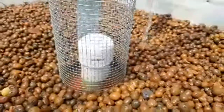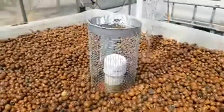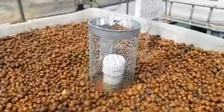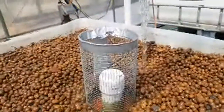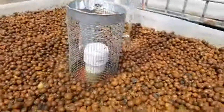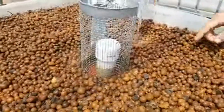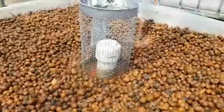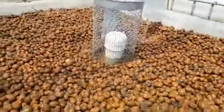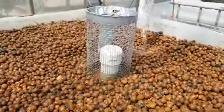The other thing we did not measure, which we can measure later, is how high is the standpipe off of the floor of the tank. Because it kind of sinks in the divot, it's not literally the one. Flush, yeah. Right. And I can't be sure that the distance from the uniseal is the real important one. It might be the distance from the bottom of here, which is higher. If we're dealing with really sensitive parameters of whether or not that bubble collapses or not, this may not be optimal.